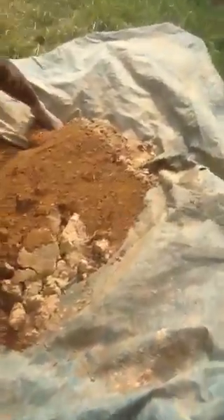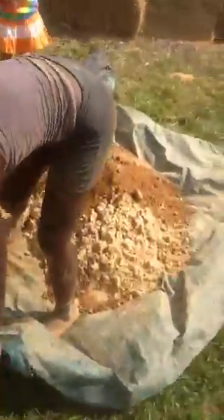And this is how we're mixing. We put in two parts clay and one part sand, but that's not entirely true because there's actually some sand already in the clay, so it's actually closer to one part clay to one part sand. But after we measured to find out how much sand was in the clay, we realized we had to do two clay and one sand.